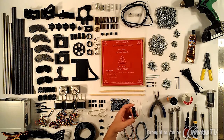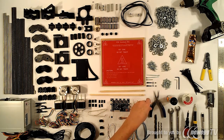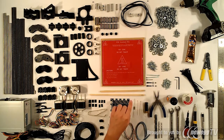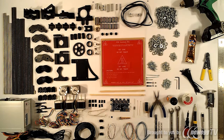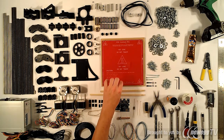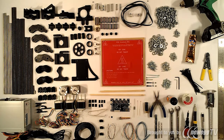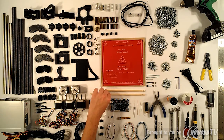The kit also comes with a J-head hot end that takes 3mm filament and has a 0.5mm nozzle. The hot end includes a heater resistor and a thermistor, plus an extra thermistor for the heat bed. This is an MK1 heat bed, which comes with a tempered glass custom cut glass bed, a quarter inch MDF board for the bed, a 234mm measuring stick, and a 290mm measuring stick.